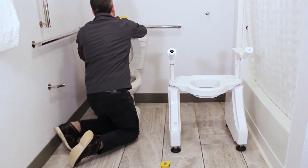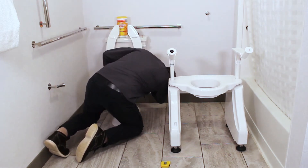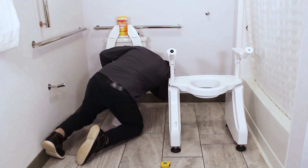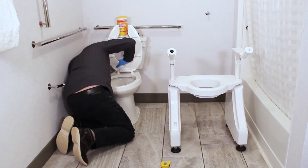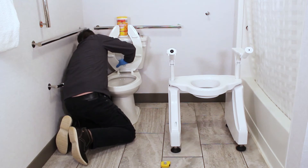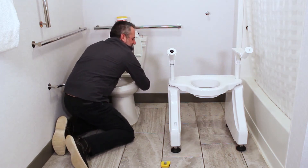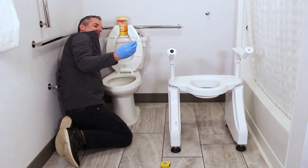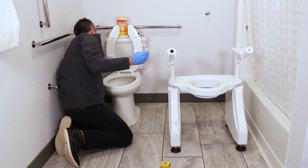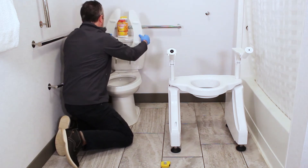The only tool I'm going to need is my pliers — and it's also very clean, so I don't need to use my wipes this time. I'm going to get under here and just turn the bolts to loosen. Once you get it started, it usually comes right off. On these bolts, in most modern toilets, they're going to be nylon, so they're not rusty or anything like that. Just unscrew them both, get both unscrewed. There's the nylon bolt — it's actually a nice long one, which makes it even easier to work with. And then it pulls right off.